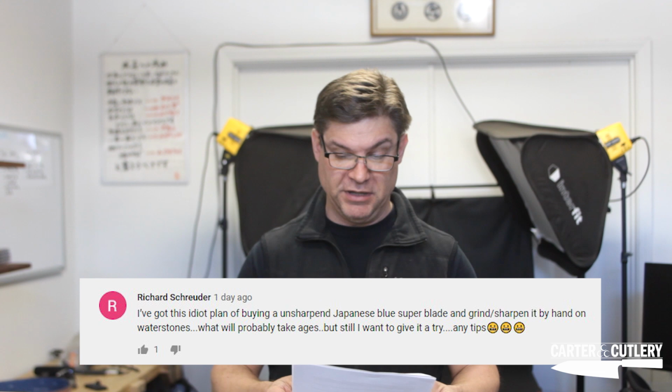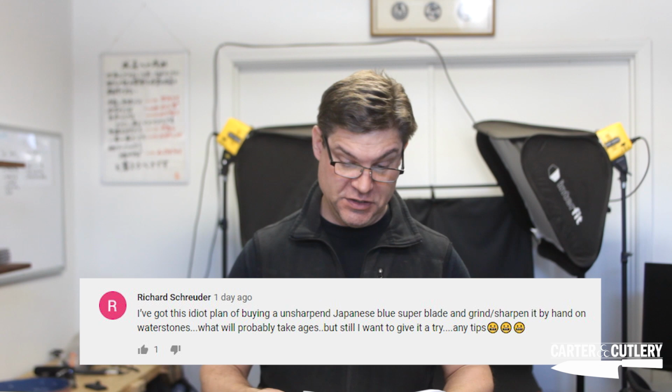Question one: I've got this plan of buying an unsharpened Japanese blue super steel blade and grinding it or sharpening it by hand on water stones, which will probably take ages, but I still want to give it a try. Any tips? Yes, if that's what you want to do, first thing you got to do with sharpening is always make sure the blade is straight first, especially if you're going to do a Japanese chisel ground knife, right?